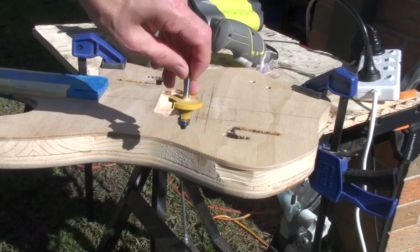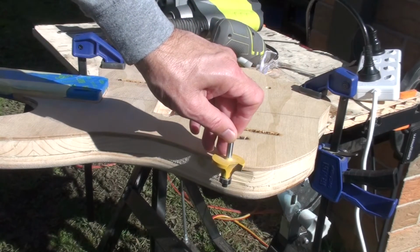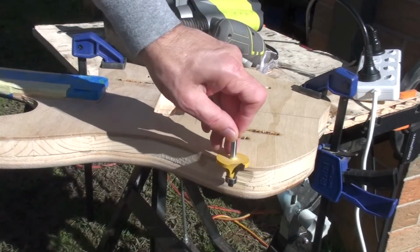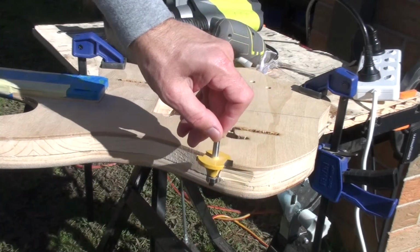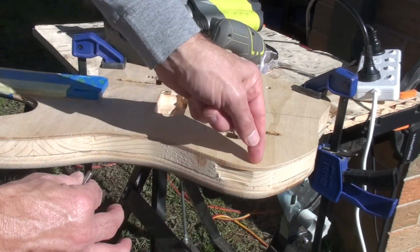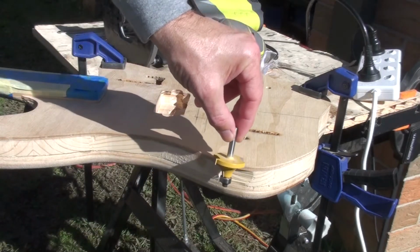But as you can see, the router bit's going to be about that height. The wheel of the router bit, this wheel here, is going to run through about here, which is going to cause this router bit to dip in, and then we're going to get a straight line here instead of a curve, which is terrible. So,